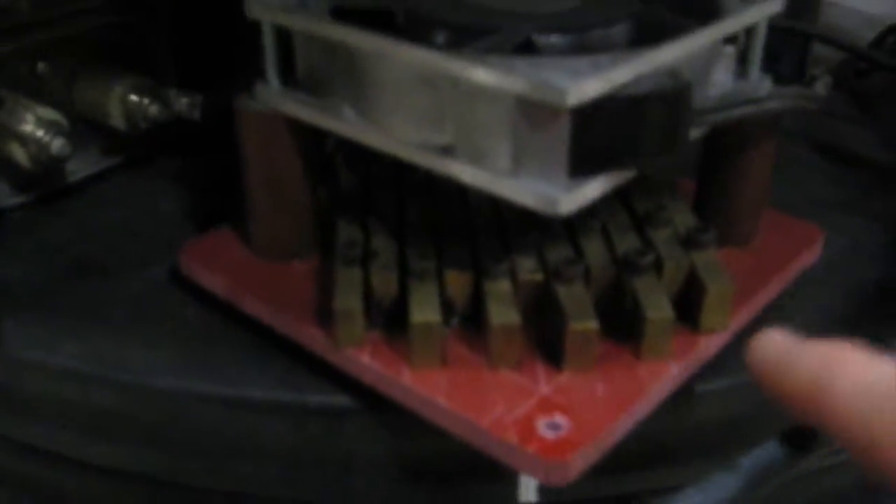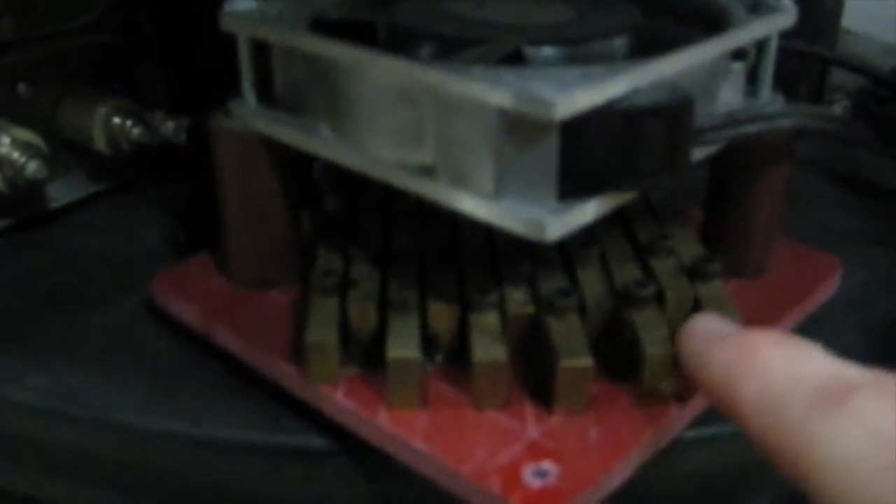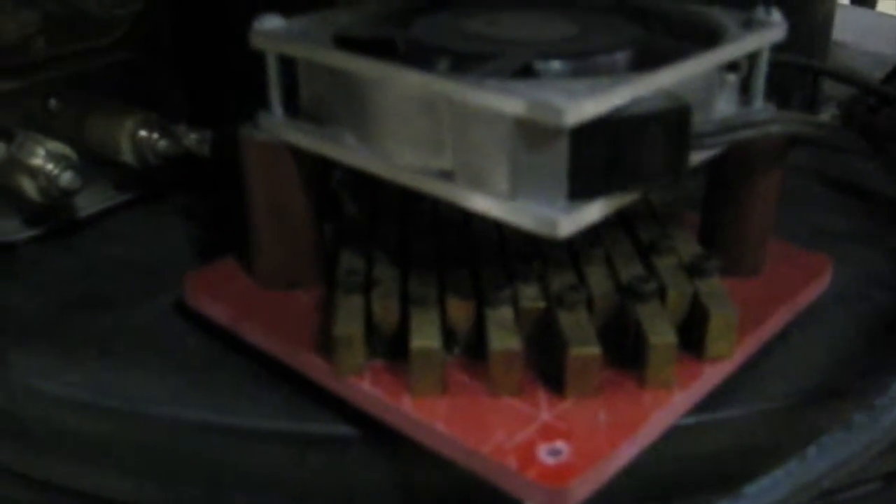These are brass rectangle plates that have copper wire like a ribbon bent in between them, so that I can change the spark gap length. I short out a few of these, and if I wanted to make it longer I'd pull a few out, or if I wanted to make it shorter I'd short them out. I also added a computer fan, but the only issue is it's not powerful enough — after a few minutes of operating the Tesla coil it really smells like ozone, so it would need a bigger fan if I were to do it over again.